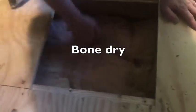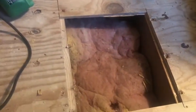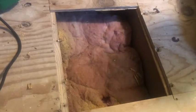Yeah, it's perfectly fine in here. Nice and dry. Well, it's got one bat of insulation, looks like R16, which is perfectly fine. Okay. So all we're going to do is run a 2x4 from here to here, split the difference, here to here, split the difference. Put that board right back down there and glue it. Okay. That sounds good.